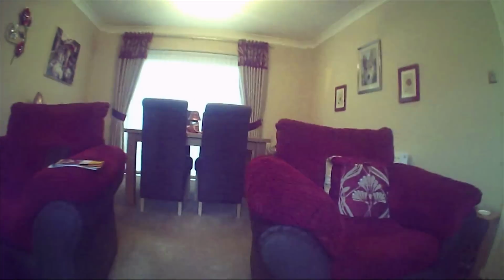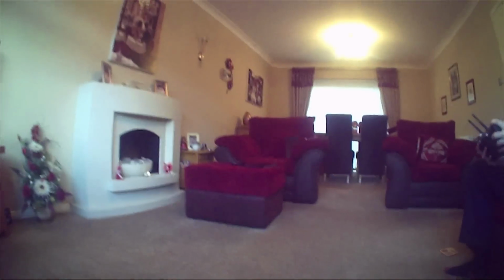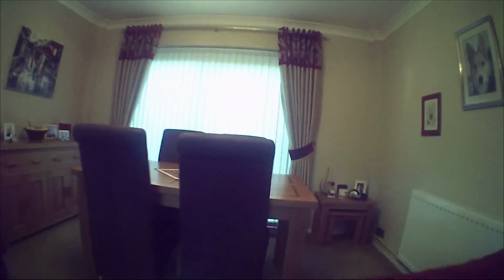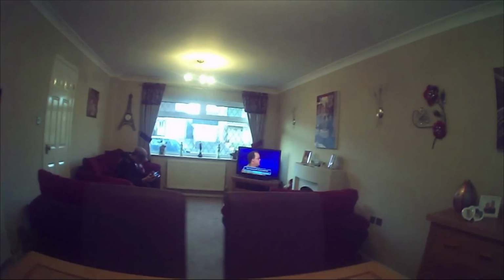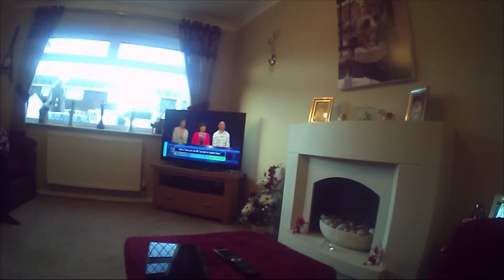And for this size, you can see I'm recording at the same time as doing FPV, and it's definitely doable. A lot of people commented on my last video that there seems to be a delay. There's no delay at all. There's a slight frame rate drop as the processor is doing both, but there's definitely no delay. I mean, there's a slight delay anyways on the FPV feed, as there are for all FPV feeds, and it's exactly the same latency when recording as not recording. You can see here my head's down, FPVing, absolutely no problem. The biggest challenge was the light. I think this setup's going to be much better for outside.